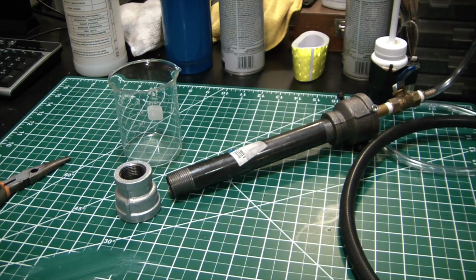That being said, if any of you guys are using this indoors for a propane forge burner, there is that hazard of zinc poisoning, and because of that, I should have probably warned about it in the video a bit. But if you're working with that kind of stuff, that's probably something you should hopefully know.